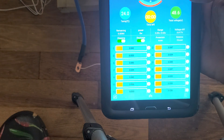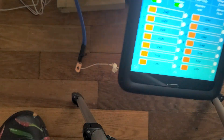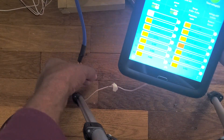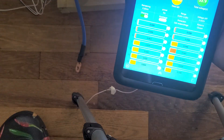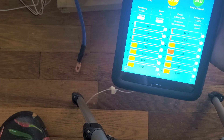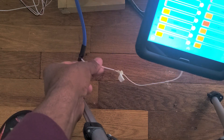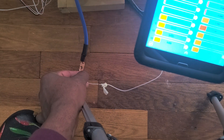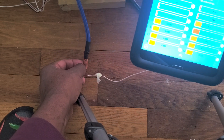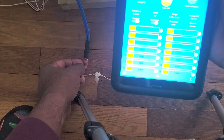Now I'll show you how to put the BMS together. Don't forget to subscribe. I'll show you that if I unplug this thing here, the numbers are going to be funny — you see? There we go — the number is funny. You need the first negative on the main board connected properly. I'm pressing it there — it's touching now. There we go, it's back to normal.